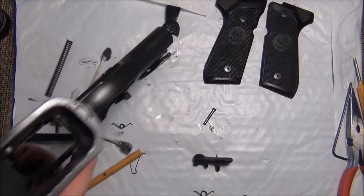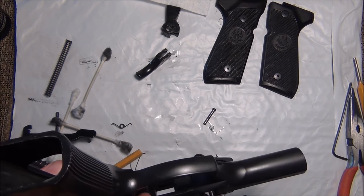Now, the last part of this is a pain. This goes in there. The orientation, as long as it's 180 degrees straight, doesn't really matter. The spring tension on this is going to suck — that's what is going to matter. There's no hammer in place, so if you need to make any hammer adjustments you're going to need to push this bad boy here. I can't do this in front of the camera. So I got it most of the way in there, going to give it a little pressure and push it through. While this is properly aligned, you will not notice any resistance — the pin will fall straight through. You want to kind of do it at a 90 degree angle. And there we have it. The hammer is installed. That was actually super easy because sometimes that hammer strut likes to dance around in other guns.